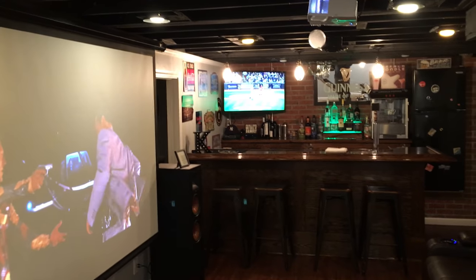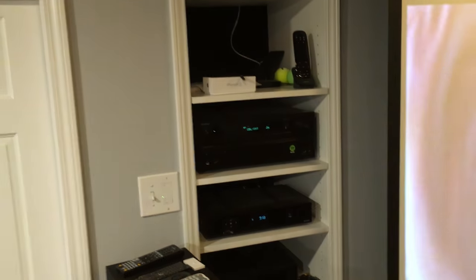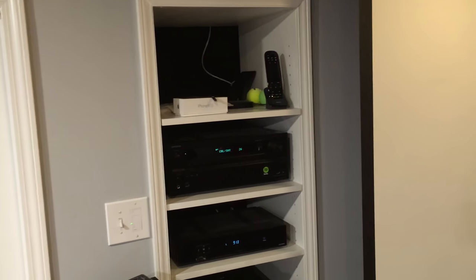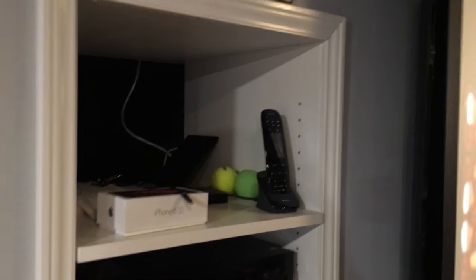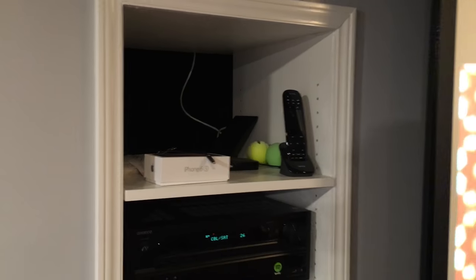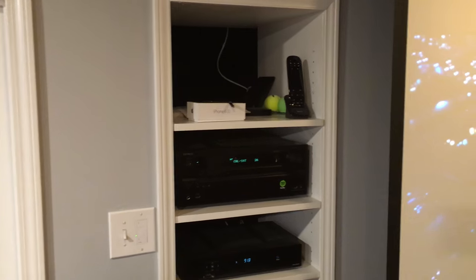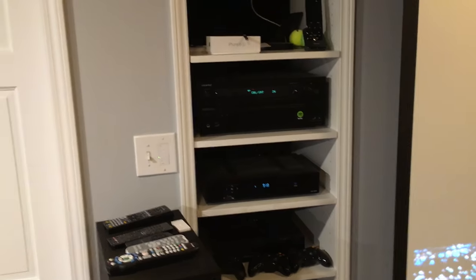For my components, I built this rack myself. I took some MDF, cut it on my table saw, and painted it white. You can buy a jig on Amazon to make the shelf pin holes in MDF so the shelves are adjustable with clips. It's a lot cheaper than buying closet components from Home Depot, and the shelves go up and down as needed.